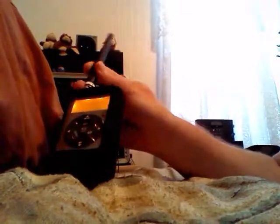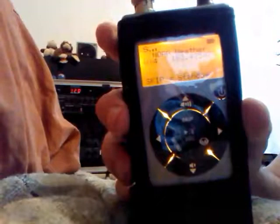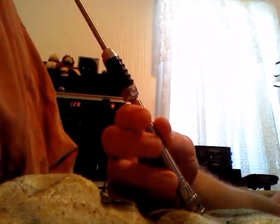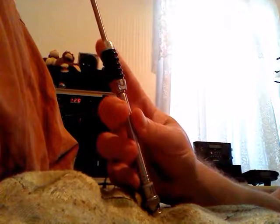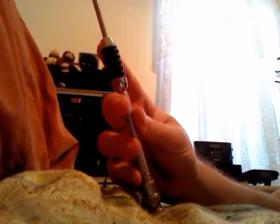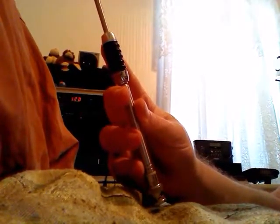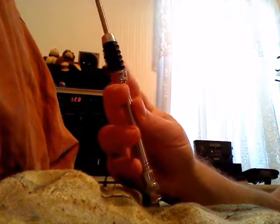I'm getting four bars on this — about 4 dB. And when I switch back to the stock Radio Shack unit, it goes down to three. So you definitely get about a 20% increase according to the meter. If there's five bars, 20% would be about each S-bar on there approximately. I would recommend the 20-006 telescopic whip. There are a lot of tricks with these — experiment at your leisure for best reception. They work great; definitely works better on VHF low or something like that. It even picks up CB a little bit. I'm not sure if you can transmit on that — I think you might be able to — but I wouldn't really put anything more than four or five watts out of this. I don't really know what the coil is rated for. It's not very heavy duty — it's kind of chintzy.